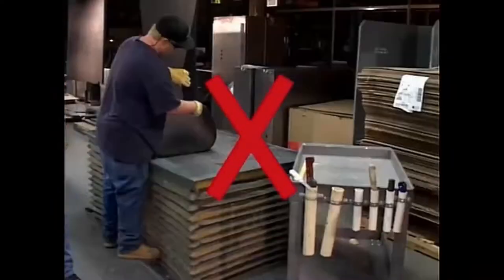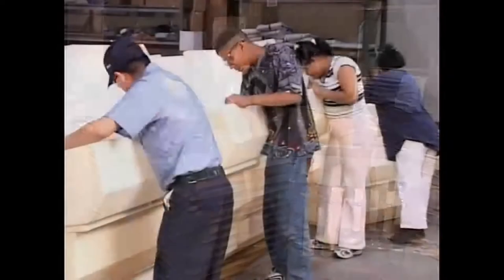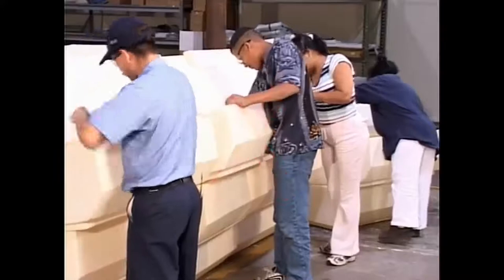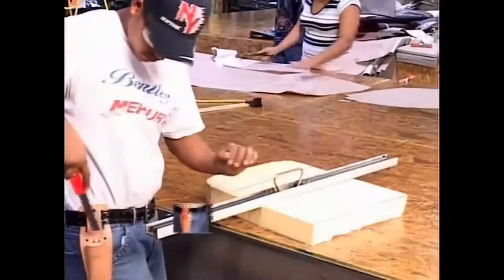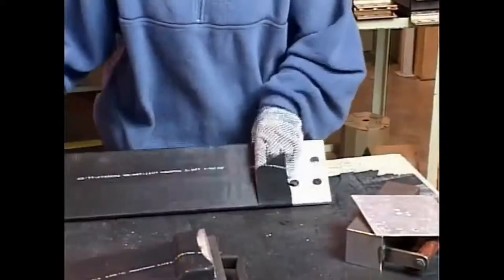Using common sense and good safety practices while cutting can prevent many knife injuries. However, you must keep safety in mind before and after cutting as well. Never hold or carry a knife by the blade — any type of misstep could lead to an injury. This includes handing the knife to someone else while holding the blade. Never place knives with exposed blades in your pocket, even for a moment. This all too familiar practice is a danger to both you and your co-workers. To prevent these types of situations, always return a fixed blade knife to its sheath, scabbard, or designated storage area. When using knives with retractable blades, always close the blade before handing it to another worker.